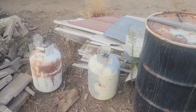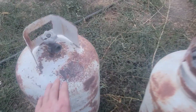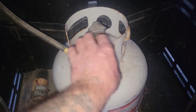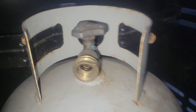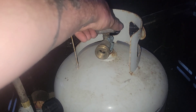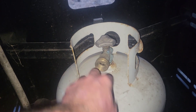Let's get it emptied out so we can cut on it safely and start building a fuel tank. With this style of propane tank, the valve, if you open it, will just release pressure. On the updated or newer style, you have to push inside of there to open that kind of valve. So if you just open it, it does not release any pressure. Just because you open it and don't hear a hiss, don't think that it's empty.